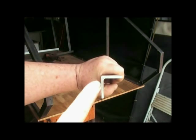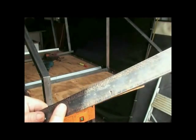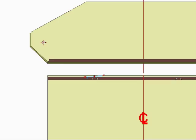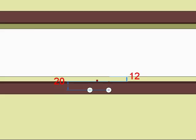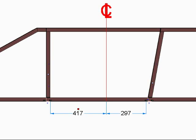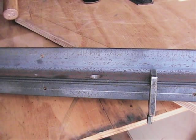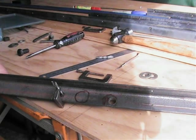For the frame I have used 30 by 30 by 3 millimetre mild steel angle, onto which I have measured and pre-drilled the screw and bolt holes for the suspension mounting bracket. The half inch holes are located 20 millimetres in from the face of the outer flange. I recommend for accuracy, consistency and ease of production that you clamp the two base angles together when you drill the holes. It's also best to use a drill press for this procedure.